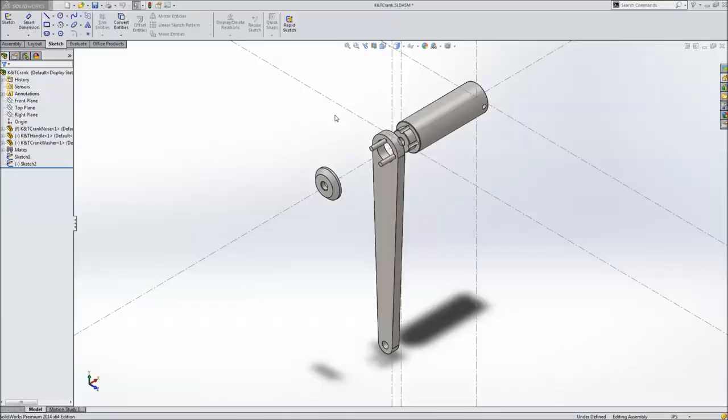Hey guys, okay, here we are at the computer. We're in SolidWorks, and we got the assembly here drawn up for what is going to be our crank handle. It's pretty easy to see here. We got just a few major components. We got the hub, which will be made out of this piece of 2-inch 12L. There'll be an ID, a cross hole. There'll be this half-inch